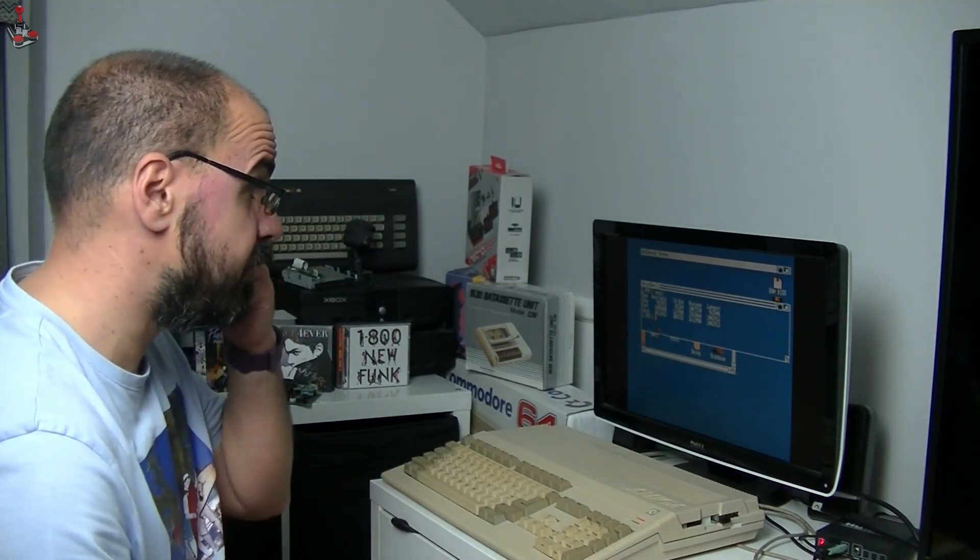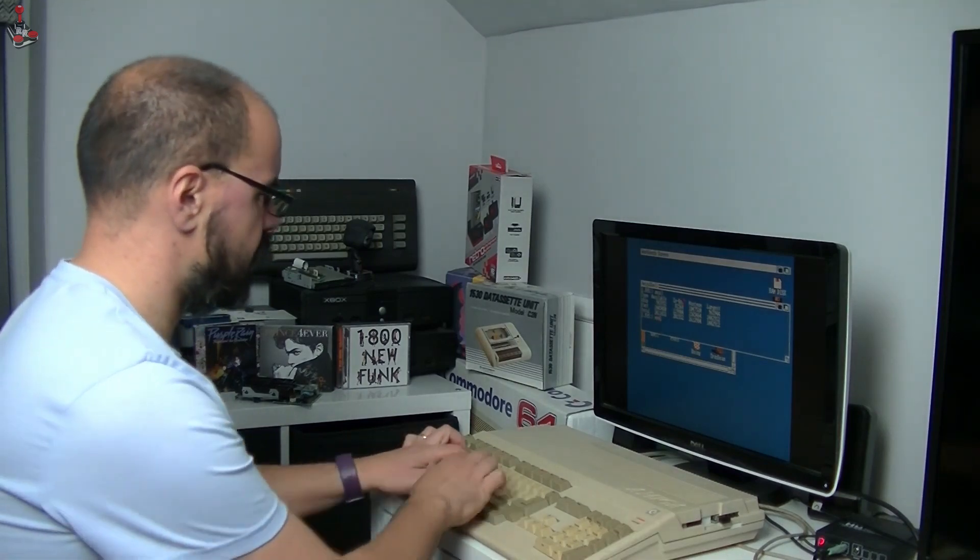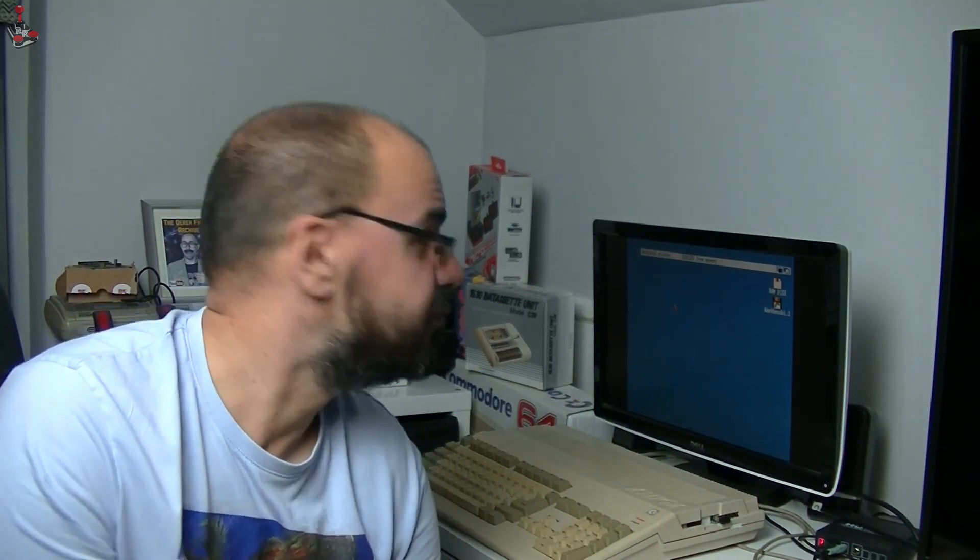The next thing will be to get a fast RAM expansion — that's the next upgrade. But for now I'm really happy with this. For a very reasonable price — all the links will be in the description — you can get this little upgrade for your A500. There's only a tiny bit of soldering to do, and I'm no expert at soldering and I managed it. I'm going to have a look at the RTC chip to see whether I've got one that's compatible — that might be the next job, adding the real-time clock to it.